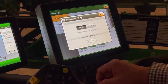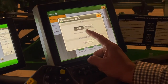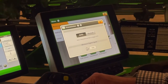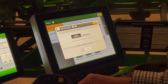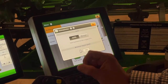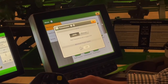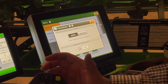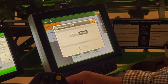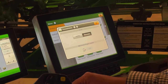Then we have our transmission. Transmission mode is auto or manual. Typically we found you can leave it in auto for most of what you're doing. However, if you're doing some high gallon work — north of 50 gallons an acre — the solution system is commanding more power, and so if we run in auto you might feel like the machine is surging as you run through the field. We found that flipping over to manual during those high-gallon type applications eliminates the surging. The rest of the time we can run in auto.